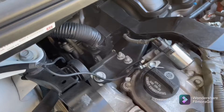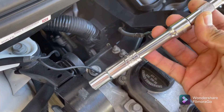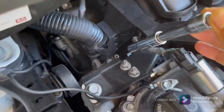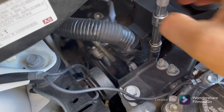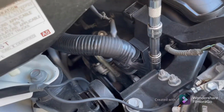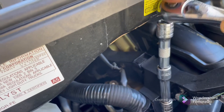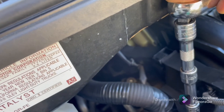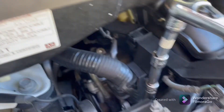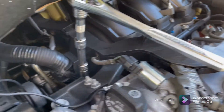The reason why you need a six inch extension and a deep socket is because when you put it in where the bleeder valve is, you need enough space to fit your ratchet in there — like so, that's why.